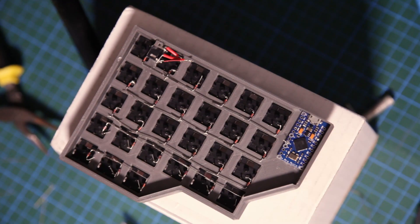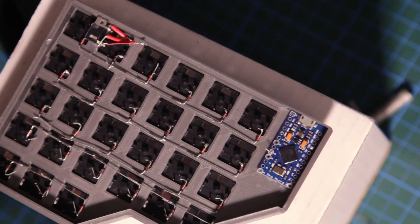For the wiring, you just need to know that your keyboard in the end looks like a grid to the controller, and that on the side of the keys there's a diode that should always face in the same direction. This way you can press multiple keys at once while the keyboard scans for key presses. I just wired the keyboard symmetrically, so I just need to plan out half of it.